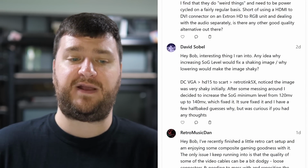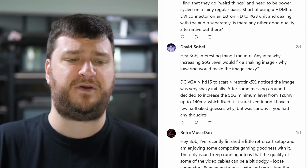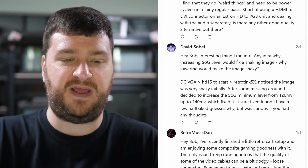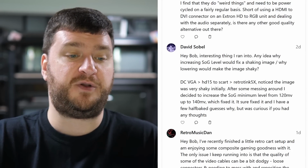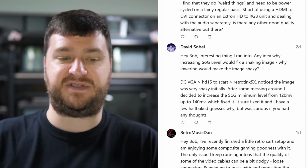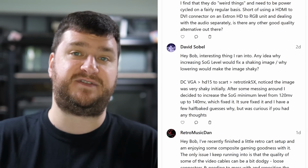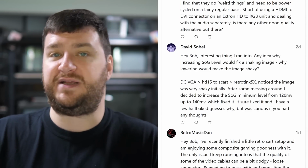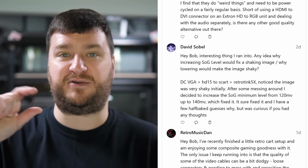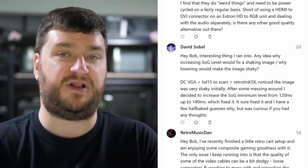It's weird that you went through that, because I have the same exact setup, and in fact, I tested that in the HD15 to SCART video, or maybe whichever one came out first. I think I tested it in one of the 2 videos just to show how that would work, and it worked perfect for me. So there could be some fringe case scenario that you have, but the bottom line is, if it's working, I would just leave it alone. But I'm pretty sure the reason why you would have that issue at all is because of a passive sync combining circuit versus an active. But as you've already seen in your setup, you could obviously see the advantages of that. One tiny little dongle versus 2 extra components, a bunch of wires, and a power brick to go into the wall along with it.